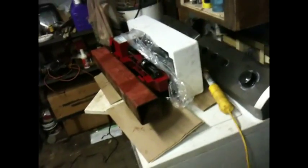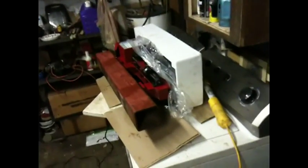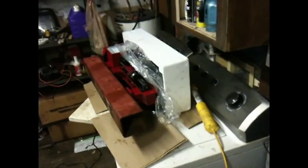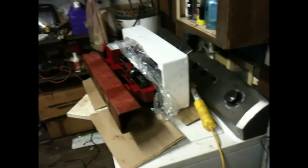Again, the back hole I did have to move a little bit. I found out after the fact that those clamps I really liked because they were fast and easy, unfortunately, because of the way I had the thing chucked up in my drill press, pulled it off location. So that teaches me to always double check it even after it's clamped down, especially after it's clamped down, because it may have shifted. Live and learn.